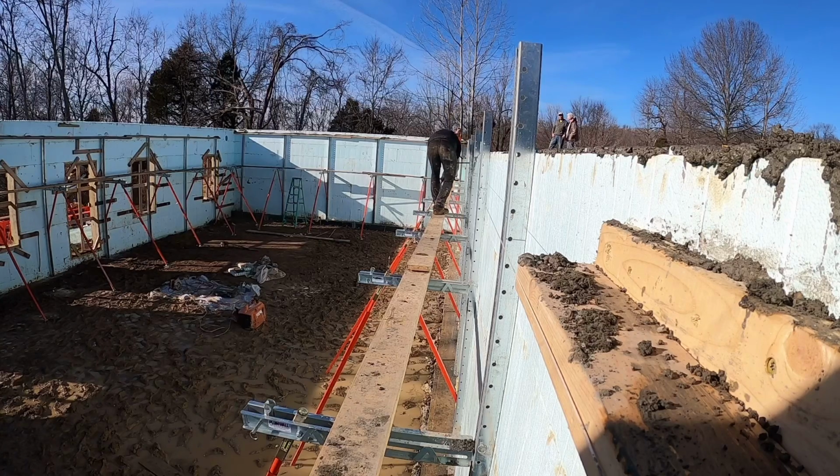By the time the wall's full of concrete, a lot of times you'll notice it'll want to start leaning out a little bit. And hopefully by the time the wall's topped off, ideally you want to be somewhere between 1 inch to 3/4 of an inch camber out there in the middle of the wall. You still want it to have a little bit of a bow in.